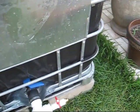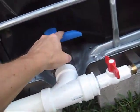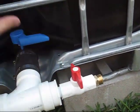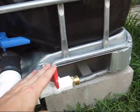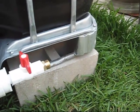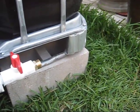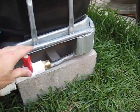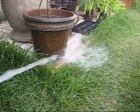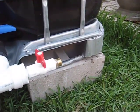Now what we're going to do is test the water pressure. This valve is open, this tube is flooded, this valve is closed. We want to see what kind of pressure and volume we get when we open up — we're just having water from the top tank. Whoa! Holy cow! That is awesome water pressure, strictly from the top tank.